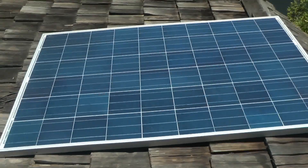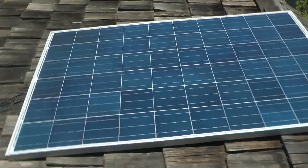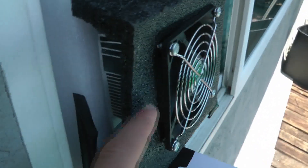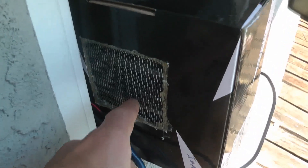This thing feeds out around 35 volts, but with the Peltier plates as load it sags down to 25, and it perfectly matches their voltage needs. Because of the two Peltier plates at 12 volts each, you get 24 volts. These are really quiet — they don't make almost any noise. The way I have it set up is I have an eBay module that cost me 10 bucks with a fan on each side and a Peltier plate in the middle, and here is a homemade one with a higher wattage rating so it cools more, with a fan blowing through the aluminum to cool the hot end.